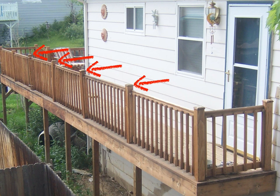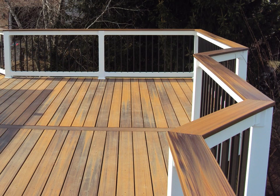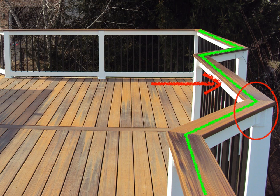With the variety of guards and deck shapes, I personally don't think it's appropriate to assign a blanket 500-pound load expectation to every post. A guard is a system, not a post. The overall shape of the guard top cap and the strength of the angles it creates all matter. Posts might be six feet apart — this load has got to be resisted all the way along the top cap. How is the top cap connected to those posts? How close are the posts? How many are sharing this load? With a continuous top cap, does that make a difference? Always pay close attention to middle posts, especially in long straight runs.